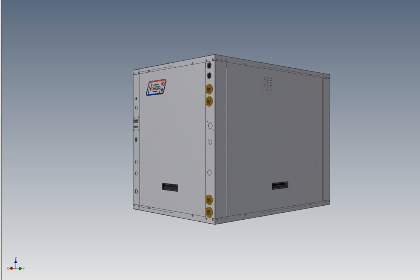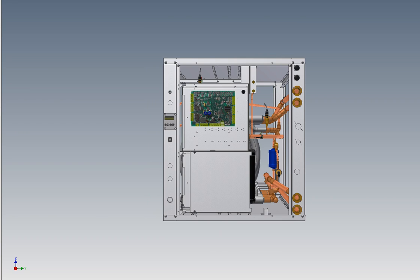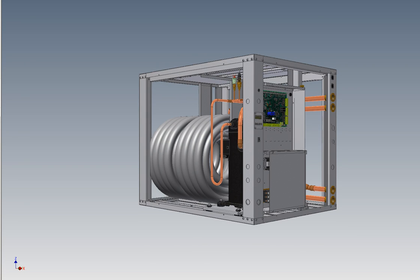Let's take a closer look at the machine. The WH series is available now in sizes 25 to 80, or nominal 2 to 6.5 tons. There is an additional 7 ton WH-85 model that's a bit of a special case in that it has a double wall heat exchanger for domestic hot water production. These models are in non-reversing varieties only — no cooling and no desuperheaters. They have the same basic layout as our regular W series, with coaxial heat exchangers with copper-nickel options and single stage Copeland scroll compressors.